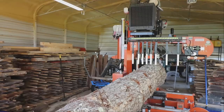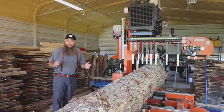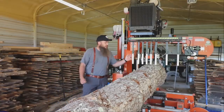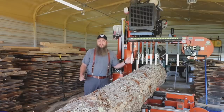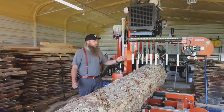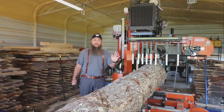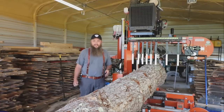And one more thing here, guys. I've went over this a bunch of times, but I keep on getting this question down in the comments, and it must be from new subscribers, but that's okay because that shows the channel's growing, and that's what we want here. These right here are the wind chimes. My buddy Brian Harrington down in Texas named these the wind chimes when we installed them about a year ago. And what they do is they guide the board back as I pull it back here on the return system. Without the wind chimes, the board is not going to be guided from left to right. It just gets pulled straight back. These wind chimes go in one direction. They don't go sideways, so they keep that board in check so it lands back here on my table.